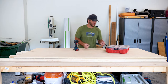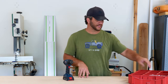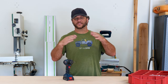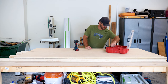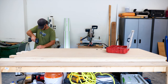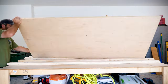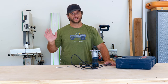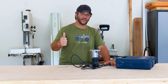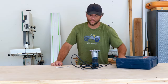After putting the glue down — which, to be honest, is not even really that necessary — I'm going to screw these pieces together. I did the glue to make it extra strong because of the overhang, but really the screws will hold it just as well. Before I run the router over it, now is the time to check and make sure there are no screws sticking up, because if you stick your stainless steel down and there's a screw sticking up, you're the one that's going to be screwed.